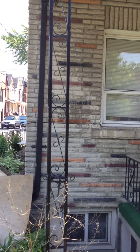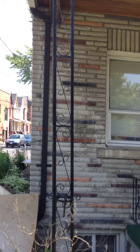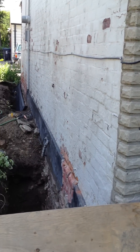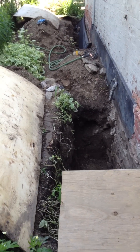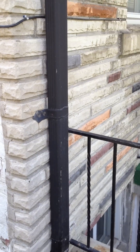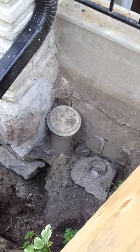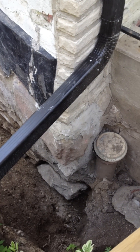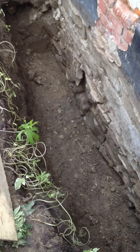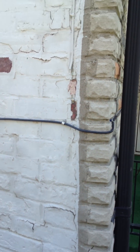This is a basement foundation wall restoration project for my old 1885 Toronto house downtown. The whole thing started when I was getting quite a lot of water in the basement. I did a little bit of a dig down to see what was going on, and I found that this downspout was connected to a sewer pipe which seemed to be blocked — that seemed to be part of the problem. Then I found a whole bunch of holes in this old fieldstone foundation, and noticed there was water damage all the way up the wall.